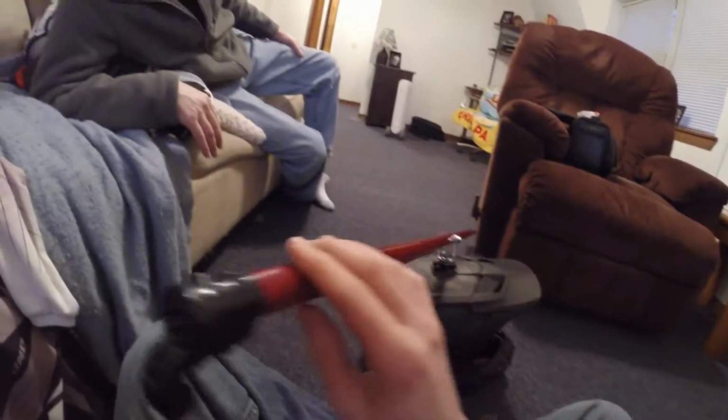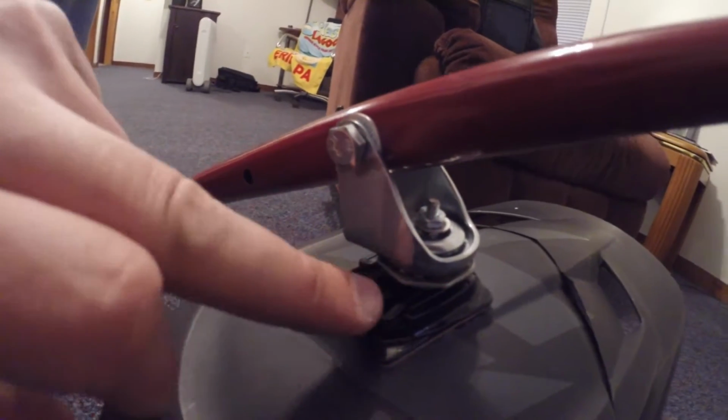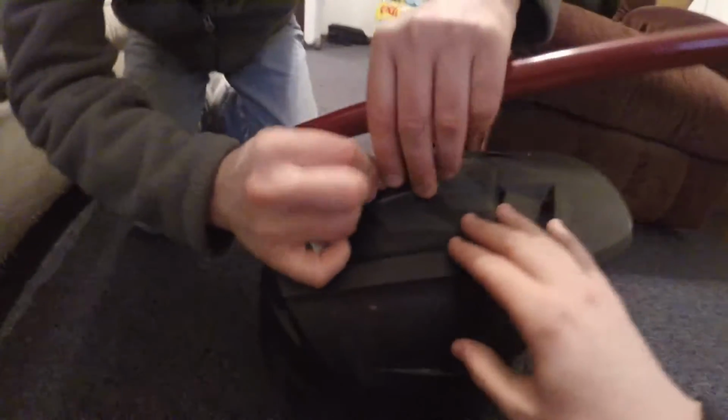Right now, this is the end where the camera mounts. Some of the screws as well. We also drilled holes in these here. Two 8-32 screws, just two small screws to fasten that on the end. We opted for a smaller screw here for clearance, so it is also able to latch into your current GoPro mount, and that worked out perfect. And we can probably just take this off, and it just slides forward.